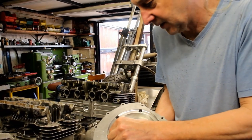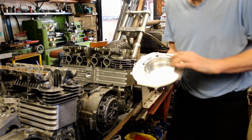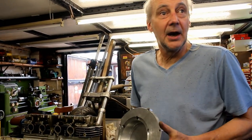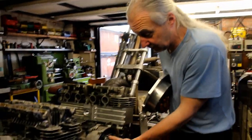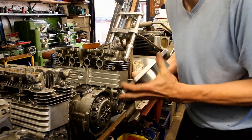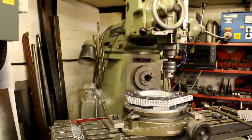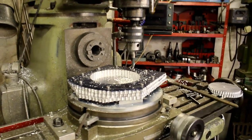There's plenty of clearance for a lock-up, but where we've machined that back it's now touching the counter - it's only half an inch thick. It's still got about six mil - we might be able to pinch another mil or two off that face if we counter-bore them in, but it won't be enough for the clutch pressure plate - it's just hitting there. You made them bigger before, and then thought we don't need it that big - went smaller. I allowed for the clutch lock-up but forgot about how far the pressure plate comes out on a standard. It's not a disaster, it's just an oversight.